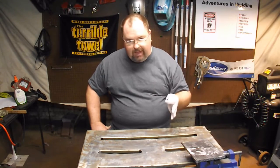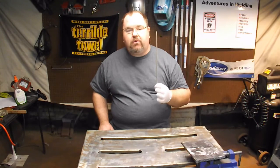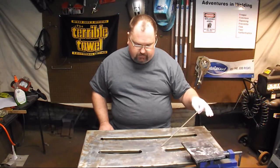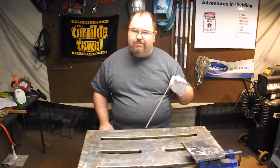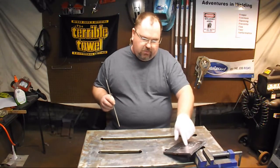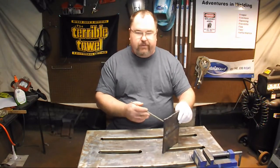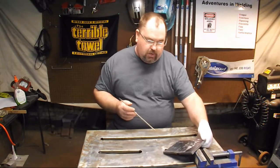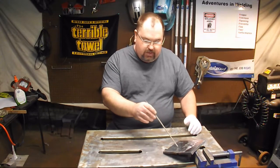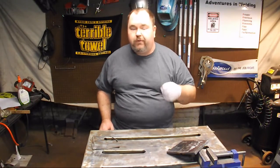Caveats: this is a flat and barely horizontal position rod. This puddle is going to be so fluid with all that iron in it, it is going to want to drip out everywhere. Flat position — yes. Horizontal position, I wouldn't chance it. I mean, if you could set something up with maybe about a 30-degree angle you could probably get away with it. 90-degree angle — not going to happen. It is useful at about a 30-degree angle in a downhand weld mode.